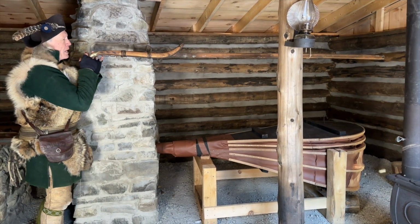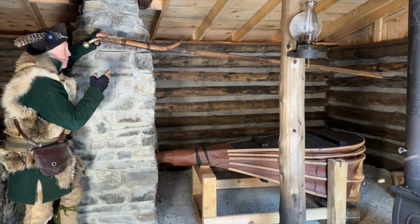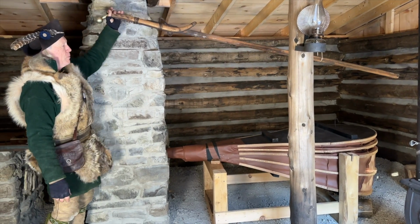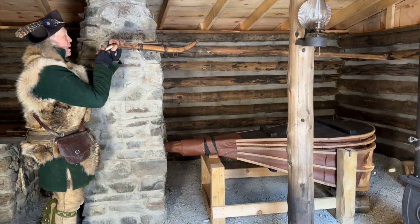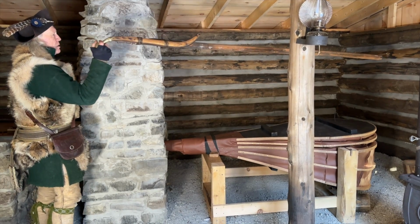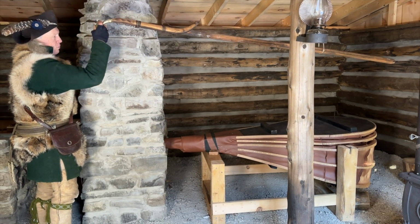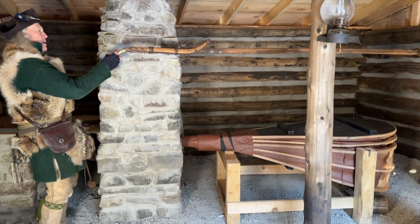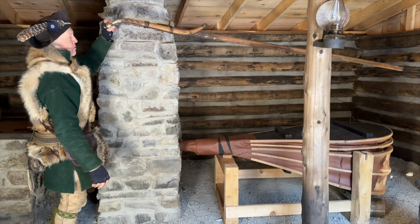Okay, what I'm doing now is just sort of experimental, but I'm looking to find the position I'm going to hang my yoke from, that my boom here will pivot from. So I'm looking for an ergonomic position. I'm going to have it rotate a bit so I can get it in or out of the way, but I need to be able to pump the bellows and manage my steel that's in the fire pot here. So I'm thinking that's just roughly where that's going to go.